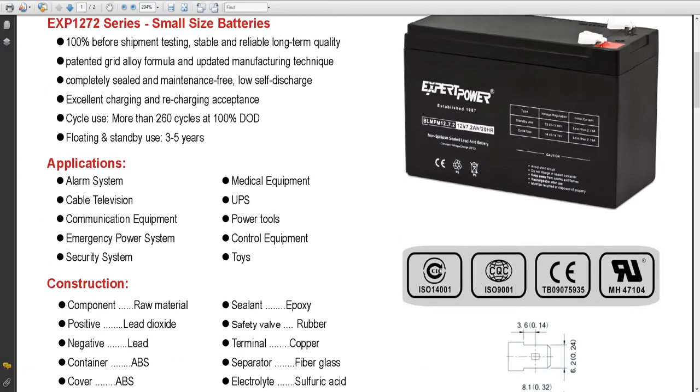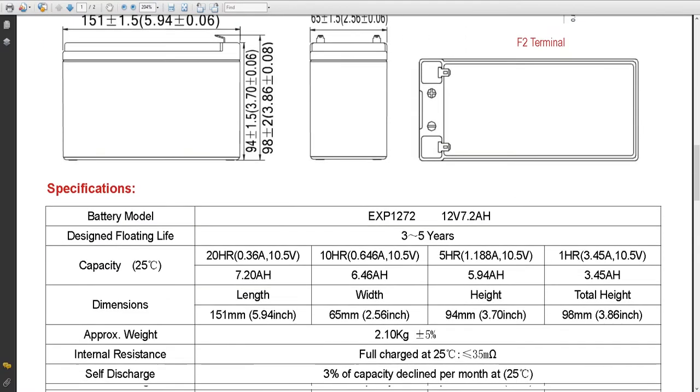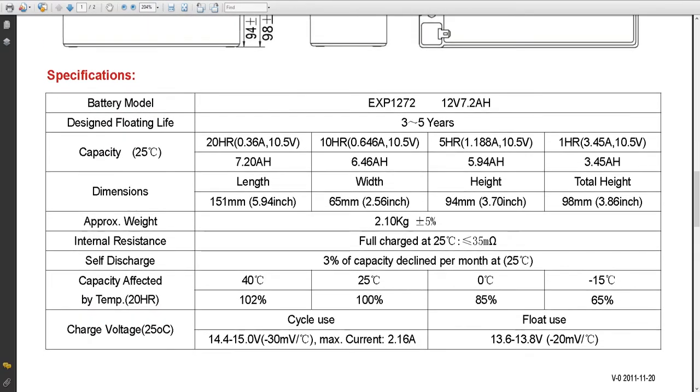Let's look at the characteristics of this battery. The capacity is rated at the 20-hour rate — at a 20-hour rate you're going to see 7.2 amp-hours. That means if you're drawing 360 milliamps at a dropout voltage of 10.5V, you'll get 7.2 amp-hours over 20 hours. That doesn't mean you're going to get 7.2 amps over 20 hours — it means 360 milliamps over 20 hours. That's the marketing gimmick that people buy into, and it's not true.